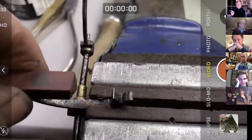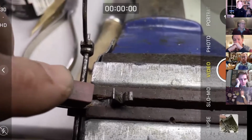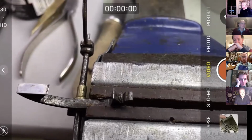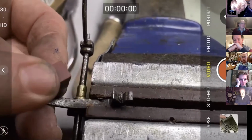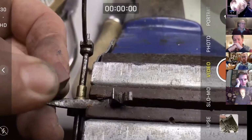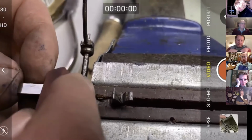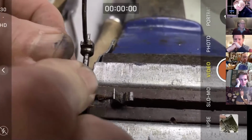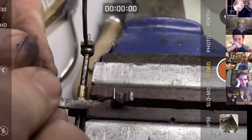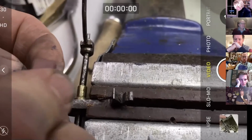Take our little Degussit stone that we talked about last week, which is crystalline aluminium oxide, ruby. Once you've done the diamond filing, just roll this round to very, very, very slightly deepen and radius that corner. So I'll just do that until it's gone. Otherwise, it's going to damage the escape wheel. I mean, you don't want that thing rounded as such, but you just want to make sure that tiny little radius there. I'm slightly paranoid about that cutting the wheel, so make sure it's really smooth.